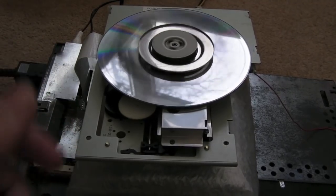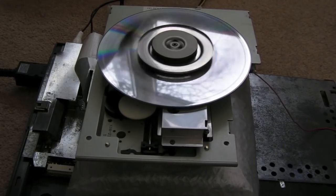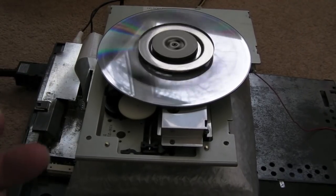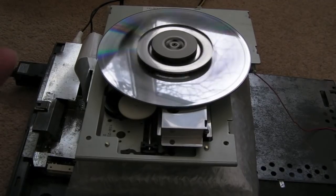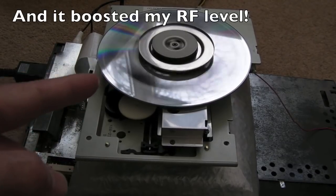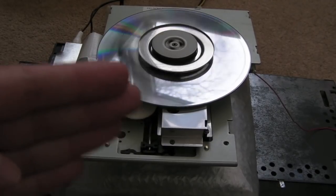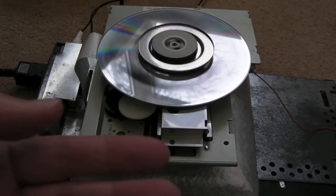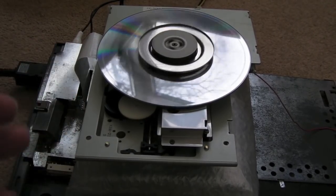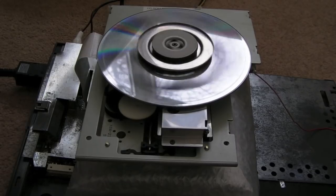What I wanted to do was try and get the RF level up a little bit, and I managed to do that by adjusting the pots to the values he had in his video. That was a good head start — straight away it gave me total reliability with audio CDs, because that was one problem: it worked okay with pressed discs and games, but audio CDs had tracking issues, especially towards the outer tracks. I had a look at Retro Game Mods' video — a four-hour video — I'll post a link in the description.